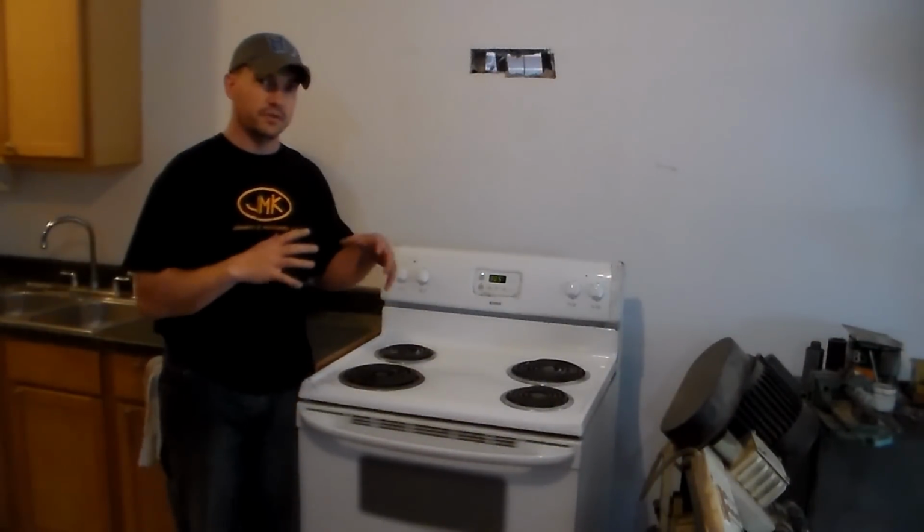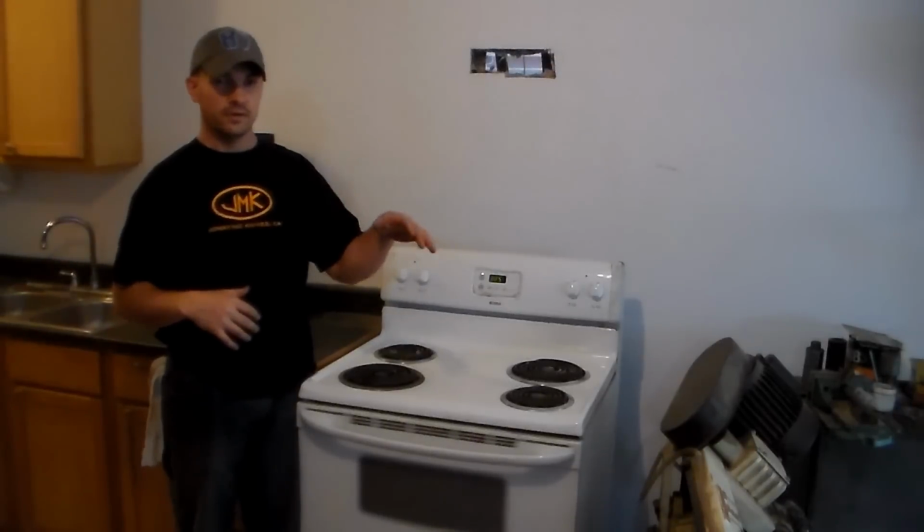Alright, we're on the other side of the shop, and the blade was taken from the salt, put into the oil, so it's hard, it's very brittle, it's fragile, and needs to be tempered back at a low temperature, which for me, the first cycle is going to be at 385 degrees Fahrenheit.